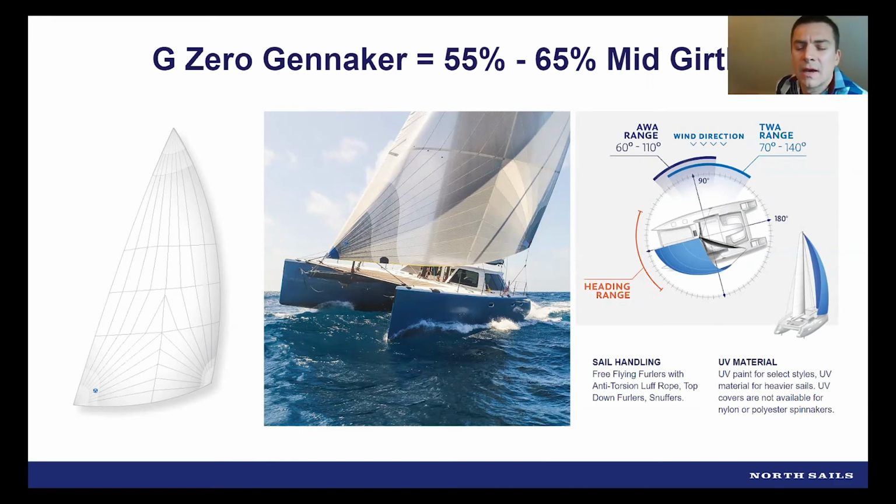Yeah, so the image that I have of that when that happens is it's going to start furling at the tack first. And it'll furl up the foot, continuing along the foot, bringing in the clew. And you'll start being able to wind up some of the lower section of the sail. But by the time the clew gets to, say, the luff, the whole top of the sail will have been untouched. It will not have furled. You would also require some luff tension. Knowing that in that question, we're saying there's no torsion cable. There would still be, say, a small Dyneema cord in the luff of the G1, but the design of that sail potentially is too long to be able to get a tight luff for that furl.